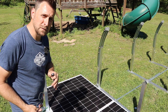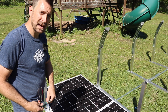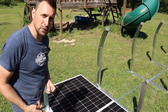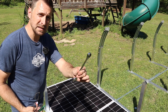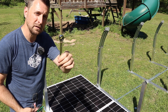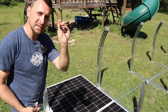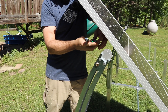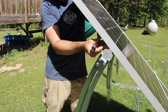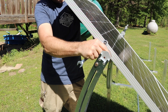The easiest way I've found is to drag the panels through the middle, lift them up from the back, and attach the brackets at the back first while holding the panel up. You can do this by yourself. They send this 13 mil ratcheting wrench with it — that's the only thing that fits inside these tubes to tighten down the nut. Hold the panel on your shoulder, take the bracket, slide it in there, line it up with the hole, and secure it with the nut.